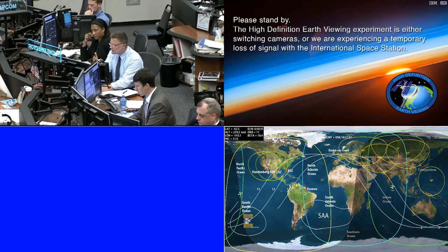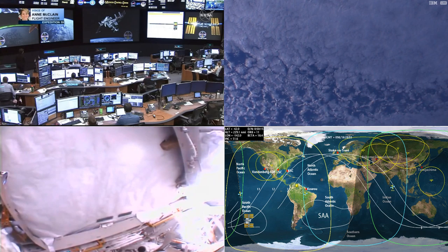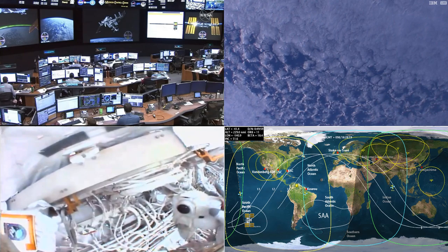Yes, that'll be very useful, Ann. And it is not. There's a part behind the veil that sticks out that's squarish and wider than all the rest. That portion is touching the panel that the other connectors are connected to, but the back shell itself of that connector is not touching anything else. Closest approach looks about half an inch from, I think that's the other side of the P3038 connector. Okay, copy, all in. Those are great words. Thanks.